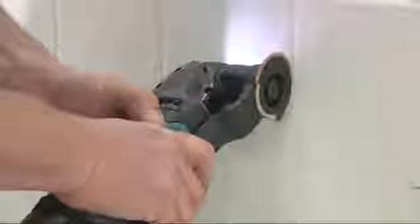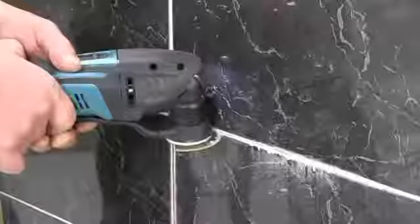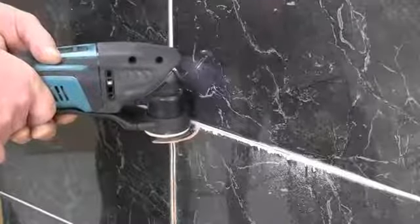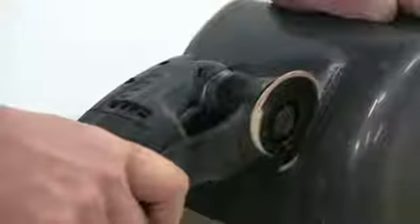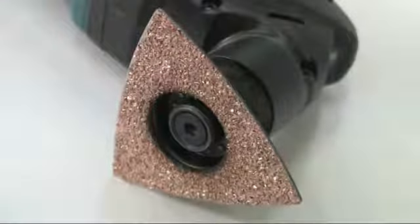There are also some useful blades for work with ceramic tiles. The B21509 allows you to remove narrow grout lines between tiles — for instance when you are replacing a tile. You can also use it for cutting holes in fibre glass and epoxy. The B21515 is more of a rasp, and this will remove accumulations of tile adhesive, cement, and carpet adhesive. You can also use it for shaping wood.